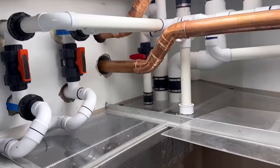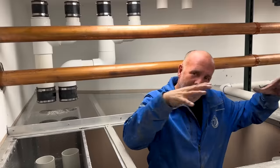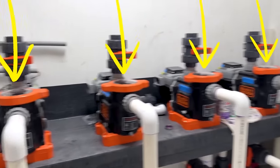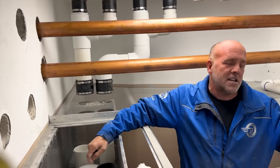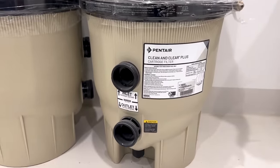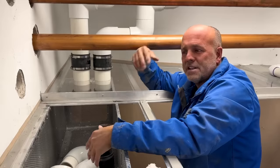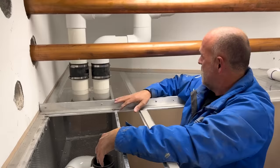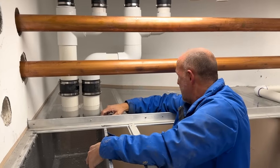This basket drains out — it catches the big debris, everything down to a quarter inch, then goes down to the floor drain which has a secondary large plastic box over it going to the pump intakes. At the pump intakes, there's another backup traditional pump skimmer basket that will likely have virtually nothing in it, because it should all be trapped here. Anything small enough to get through goes into the filter, where we get down to fine 5–10 micron size material. The pool's been full for quite some time and it's just staying really clean — it's so high up, I doubt I'll need to get into this basket maybe once a year. One vault's almost done. What you see here are big three-inch pipes for the boilers — I'll show that room later. Back to work.